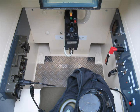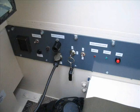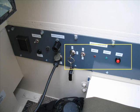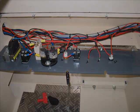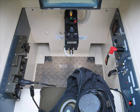With the control joystick in center position, the tank is easily operated. The joystick provides proportional speed and direction control. On the right-side dashboard, switches are placed for blackout lights on the glacis plate, a horn, the main fuse for the drivetrain, a socket for battery charging, the main kill switch, and the buttons, switches, and lights for the gun system. This dashboard is hinged to allow easy access. The small hose leading from the compressor in the back of the turret to the air tank in the battery section is clearly visible. The left-hand dashboard holds the front of a military radio set — the headset can be plugged in, but the radio is not operational; it just looks really good.